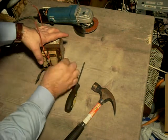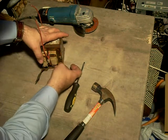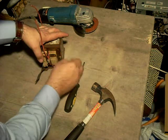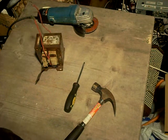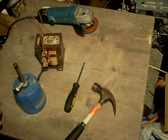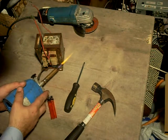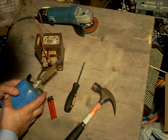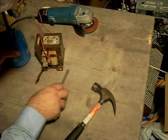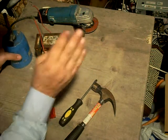This is a useful point to be able to determine whether the wire is made of aluminium or copper. You can do that by simply blow-torching or propane-torching the wire and seeing if it melts, and at what temperature it melts. I have my slightly deadly torch here. You can see that's melting, but the bead that melted has turned black, which generally means it's copper. That is copper.